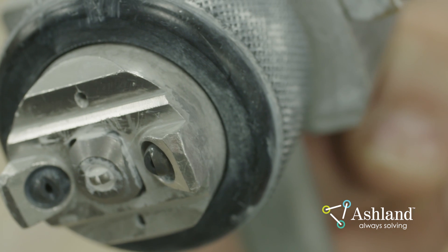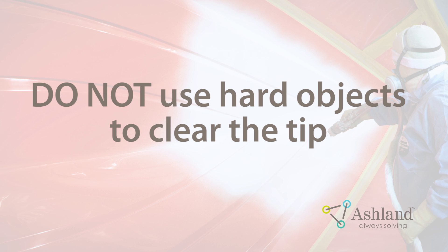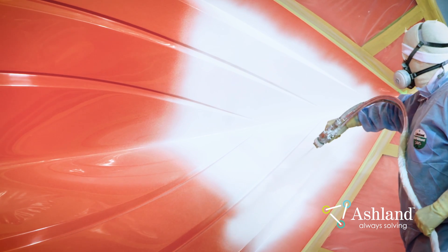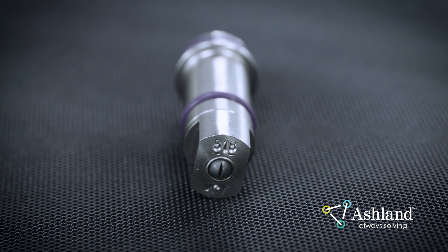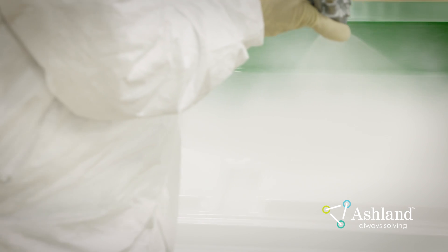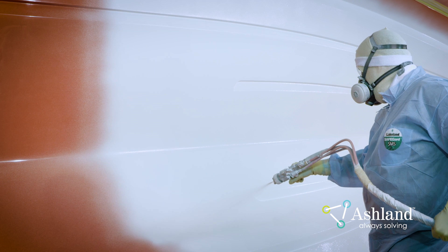Typical flow rates are as follows. The proper maintenance of a spray tip will increase the lifespan of the tip, as well as allow for the best application of the Gel Coat. Tips should be free from build-up and overspray. If a tip does become plugged, hard objects such as a wire should not be used to clear the orifice. This can cause chips in the carbide portion of the tip and will cause the spray pattern to erode, and can also cause an inconsistency in the spray pattern, commonly referred to as fingers. Tips will wear over time. Check the pattern and the flow rate from the spray tip. If the flow rate increases or the spray pattern declines, this indicates wear and the tip should be replaced.